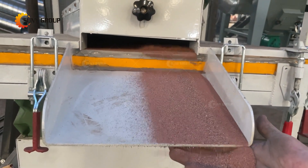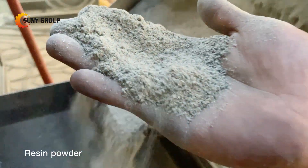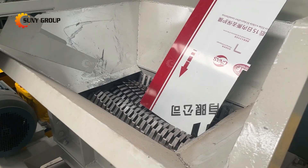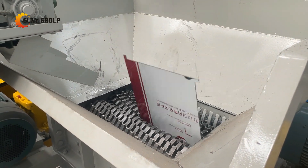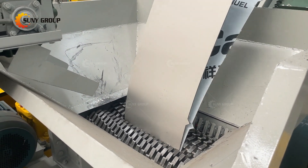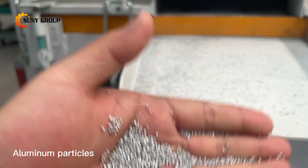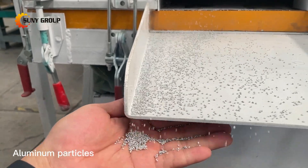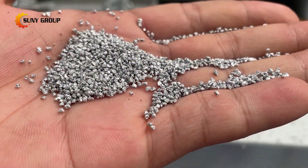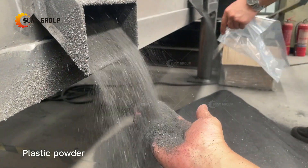Step 4: Electrostatic separation. The last step of recycling the panels is utilizing the electrostatic separation method. According to the different conductivities between the metals and non-metals, the electrostatic separator can easily divide the metal and non-metal materials. After separating, the high-purity metal particles can be sent to a smelter to be made into new metal products. The resin powder from PCBs and CCLs can be used as an additive for making WPC products or other uses, and the plastic powder from ACP panels is sent to a plastic manufacturer to be repurposed into new and safe plastic products, such as concrete bar chairs, flower pots, commercial landscape drains and pits, piping, plastic pallets and bottles.